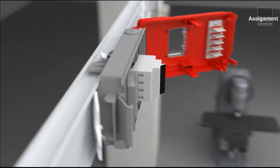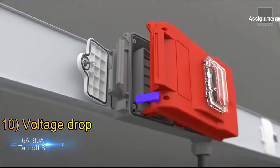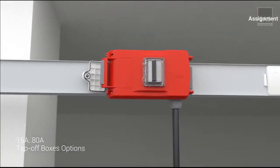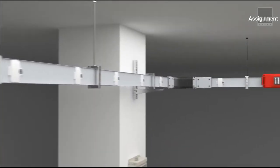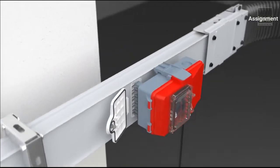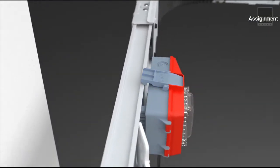And last, number ten: especially for high ampere rates, the compact structure reduces the distance of conductor access, and this reduces inductive reactance, resulting in low resistance and impedance. Voltage drop is much lower than with cables.